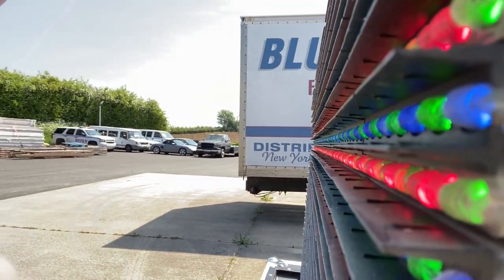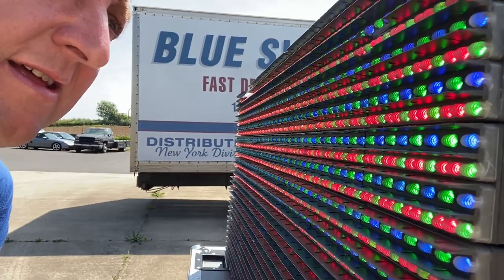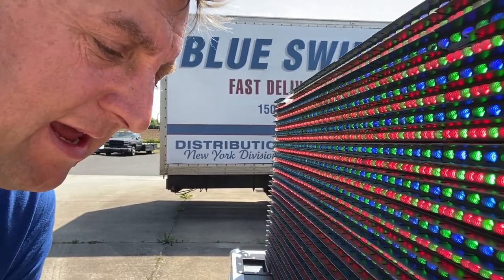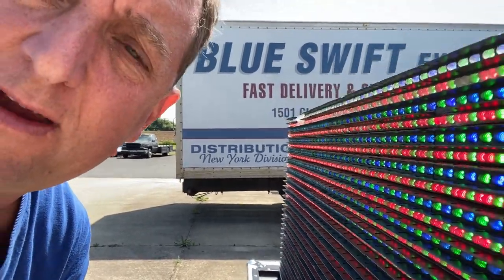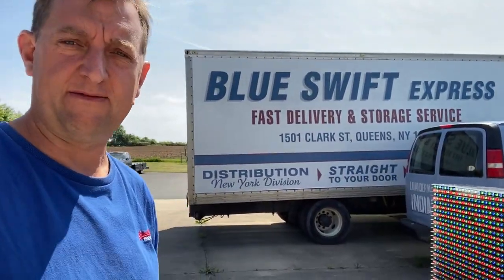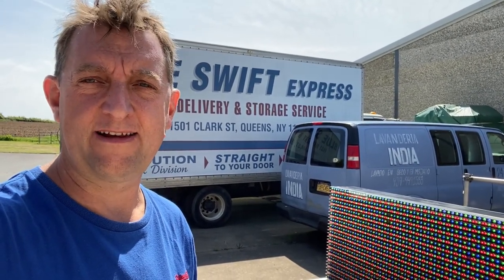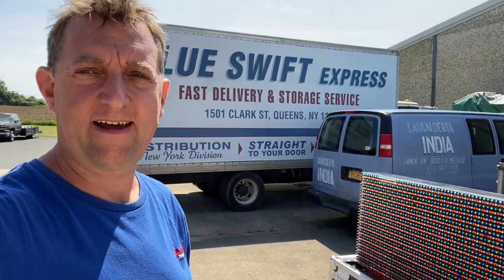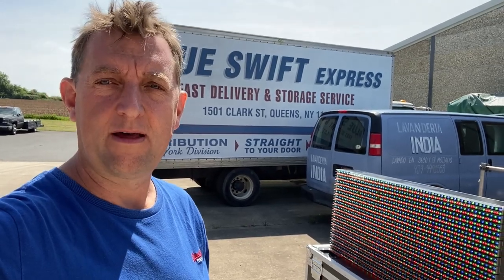As I said at the start, this was necessary because at the time LED manufacturers, I think these are Nichia LEDs, were not making LED packages that had the cosine distribution of light output that was needed for an LED screen. Cosine distribution, by the way, was invented by a gentleman called Jeff Lund, one of the founders of Invision. The idea passed to Nakamura and Nichia, who said, thank you very much, that's exactly what we needed. And ever since that day, every video screen LED in the world has had a cosine light output, thanks to Jeff Lund.